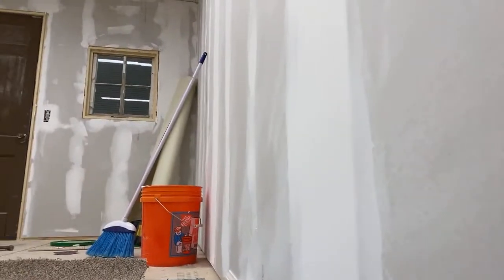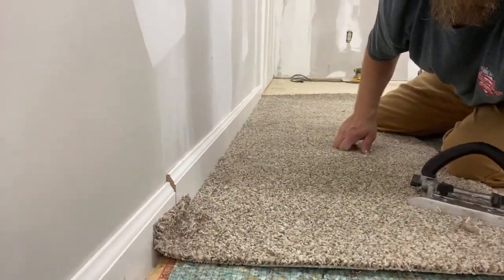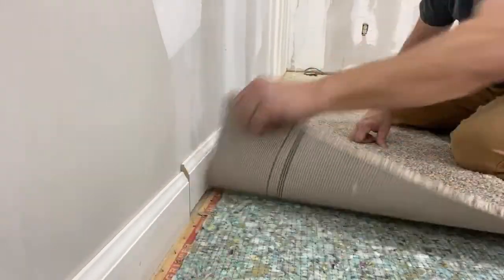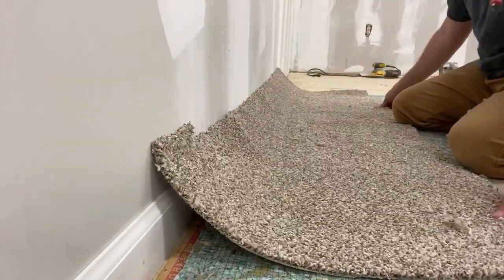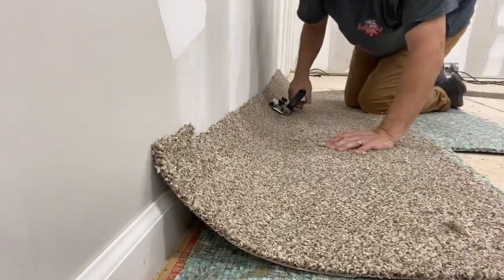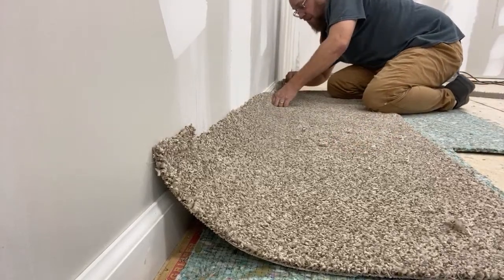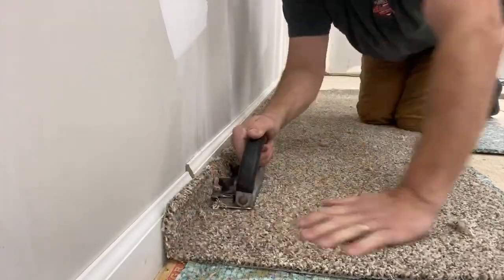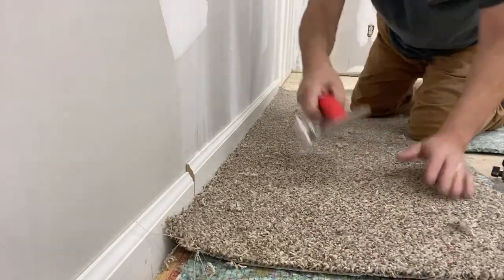So let's turn this back around. I wanna show now with the Roberts tucking tool right there. I'm going to trim it out, pull this back up, get another trim on it, start all over here, and then we're going to see how fast. You guys see how fast it took right there? It was just the normal way to tuck. So right there. Okay, now we're going to go with this.